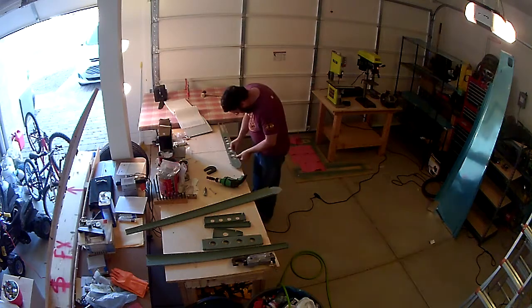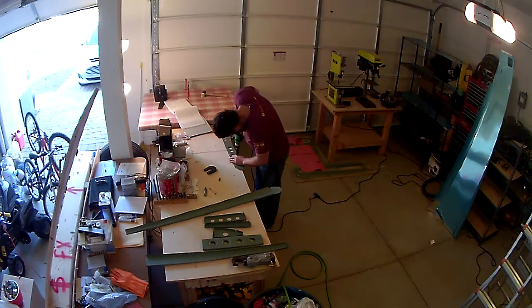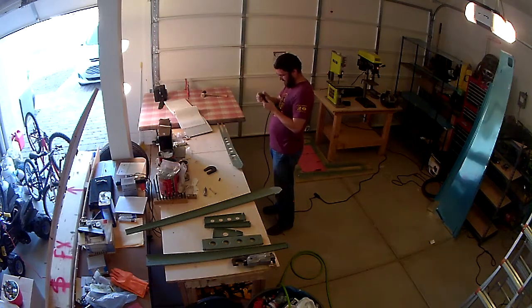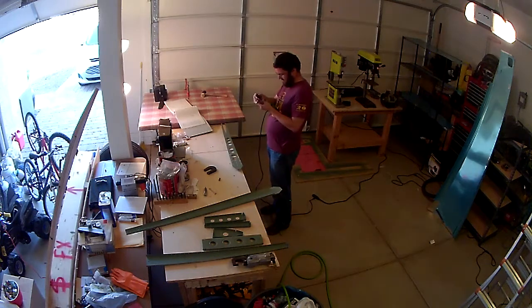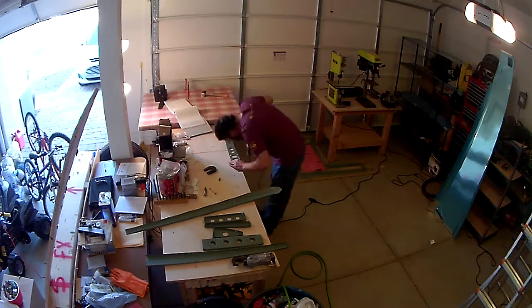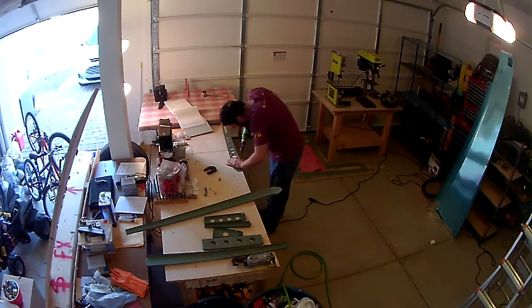I'm at the step now, while I'm editing this video, on the rudder where you have to do the double rivets, or double flush rivet, on the trailing edge of the rudder. And it's a critical step in that how well you do this step will determine how straight the rudder is. So it's going to take a little bit of effort to make sure that it's clecoed straight, and that I'm riveting in the correct order. But all that's going to be in a couple videos from now.